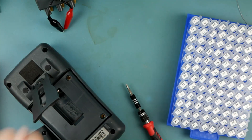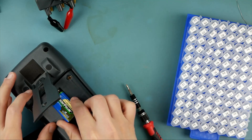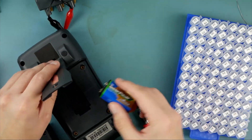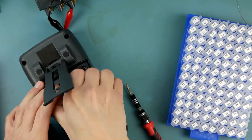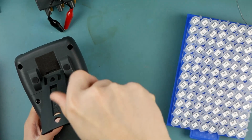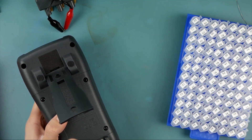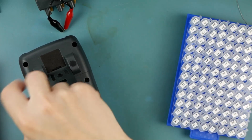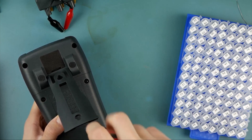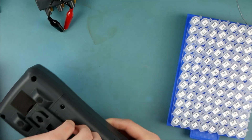Pointing back to something we did in the past: if you go back to our second half of the UPS project, we stopped trying to use off-the-shelf inductors and transformers and started winding our own — pretty decent ones, in my opinion. But we didn't have a great way to verify that the component values were correct. I couldn't verify how much parasitic capacitive coupling there was from the primary to secondary side, or that the inductance of the inductors was correct. I was just going based on my calculations and simulation, trusting that I counted correctly when winding those things manually. And if I'm being honest, that's just not great. We should really make a point to ensure that values are correct before we start soldering things together.